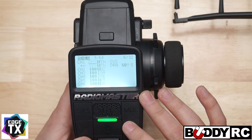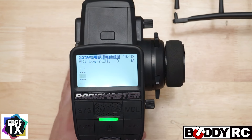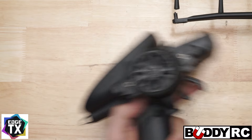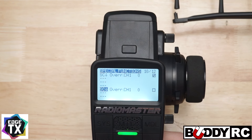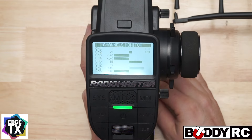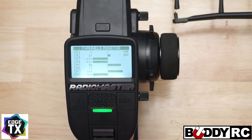On the note of the kill switch, I'll show you guys how to do that — it's super simple, probably one of the easiest things out of all of this. You're going to go all the way over to special functions. I'll make another one just to show you. Basically you'll click and you'll scroll up. As you can see it's active — all you got to do is press on it and it should say 'down' basically. I'm actually just using this little thumb switch right here. You can use a momentary switch — super simple. You're going to go SC down, that's going to override channel one. You'll override channel one and check it. Now when you go all the way back, as you can see, channel one — my throttle is working. When I press it down, there is no throttle at all. It's a really nice way to do your launches: hold it, and then as you can see, it will play the actual throttle curve as soon as I let go.